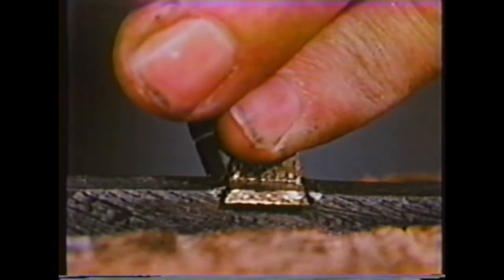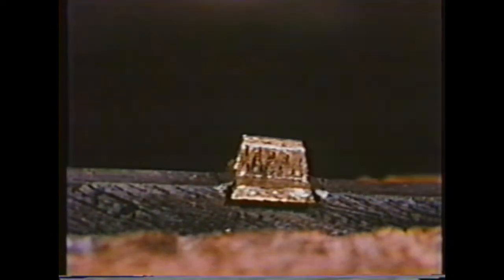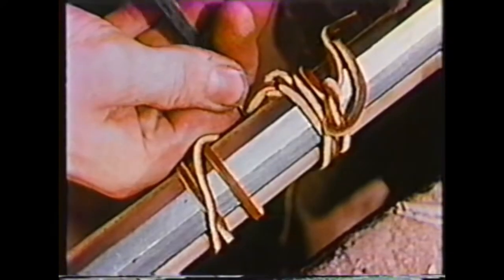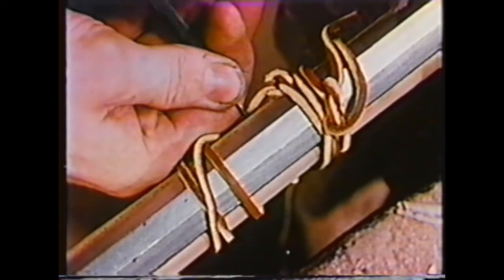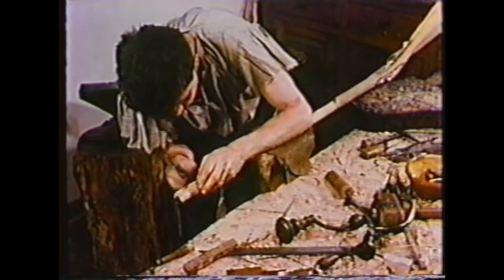Loops and pins are the most common method of holding rifle barrels in the stock. Some gunsmiths like to use flat wedges instead of pins. Sometimes military weapons, especially French muskets, will have bands going all the way around the barrel in the stock — these are not as nice looking. After the loops are fit, they are inlet into the stock. A hole is drilled through the woodwork into the cavity where the loops fit, then a hole is drilled through the brass loop. The barrel is put back in place and the hole continued on through the stock. A pin is then driven through this hole to hold the barrel in stock. Four pins hold the barrel and stock together.